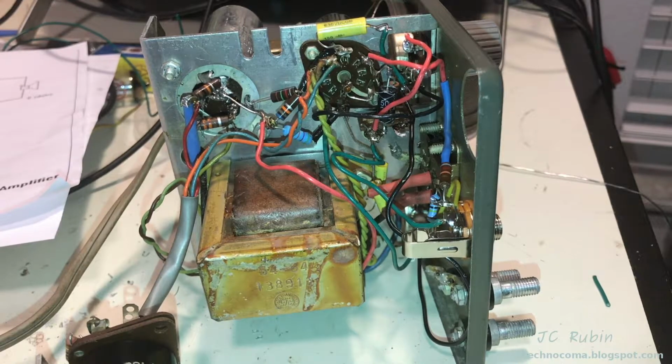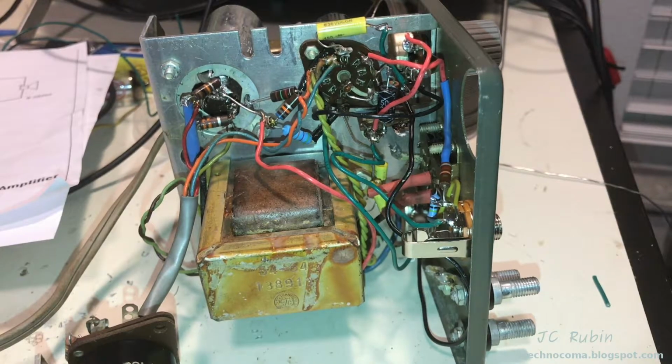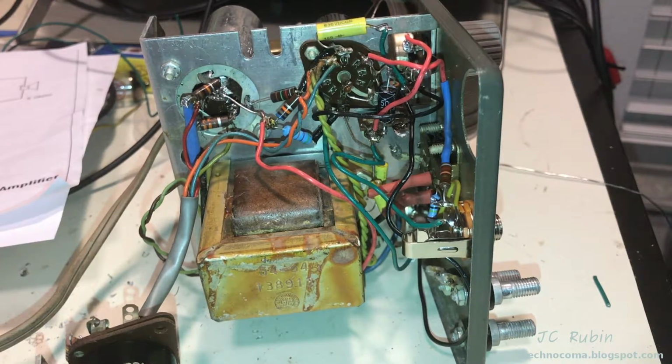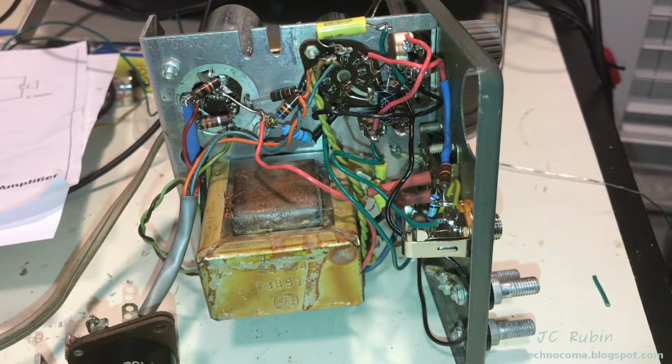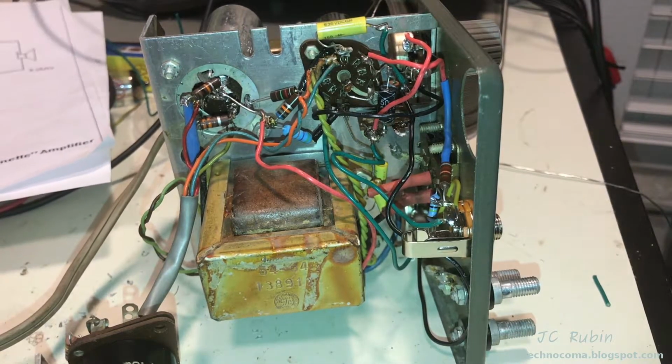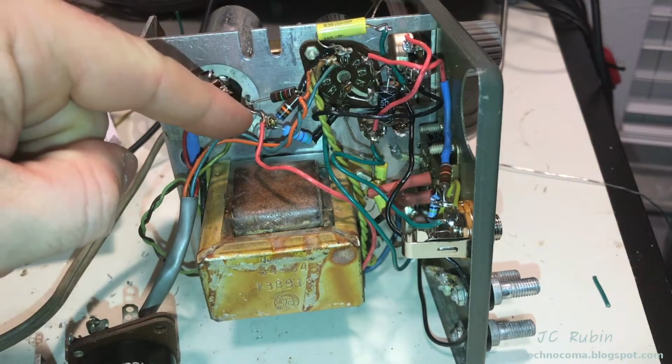I got, as I predicted, for the beam power tube, 124 was a 10 volt increase after going through all those resistors and what have you, within a safe range. Absolutely no problem there. The good news of this story is what happened to the 12AX7s. And mind you, I haven't fixed that other resistor yet.